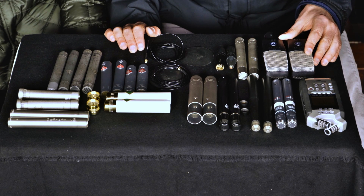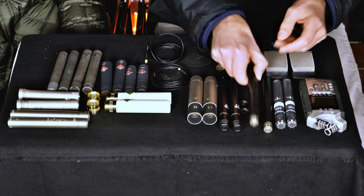In general, microphones can be classified into different families. There are so-called omnidirectional microphones and directional microphones, also known as cardioid microphones, and there are microphones with a switchable polar pattern. The omnidirectional microphone will capture the sound from all around the space where you do your recording, whereas a directional or cardioid microphone focuses in one direction, blending out a part of the acoustical event happening.